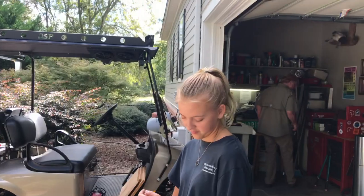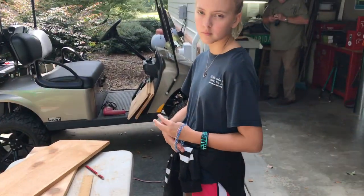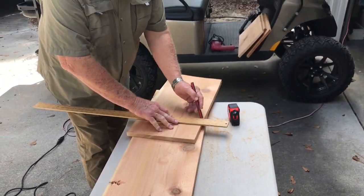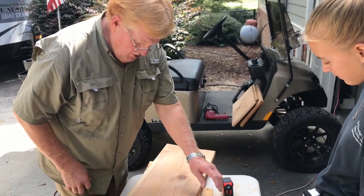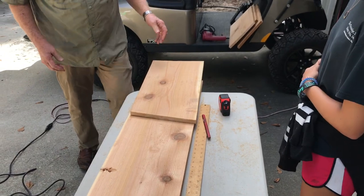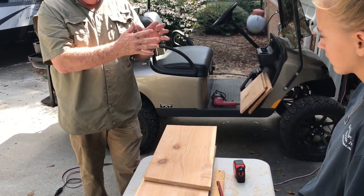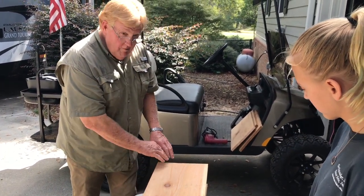Now why do we cut the hole 16 inches from the bottom? Alright Georgia, what are we cutting next? We're going to cut the door in the side. Okay, we're doing the door now. It's a complicated cut — it's a 45-degree cut. The reason being we're going to hinge the upper part, and that way you can swing the door out. It'll have enough to hold the bedding in, or the eggs if they're in there. And the reason you want to cut a 45 is so that water can run off of it.